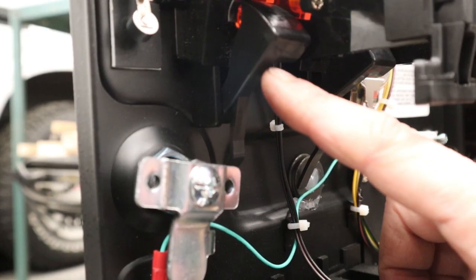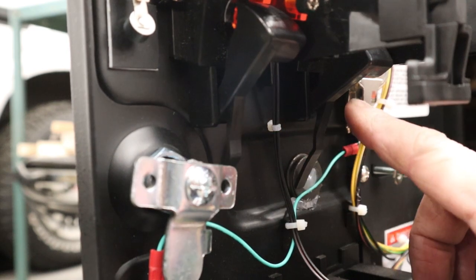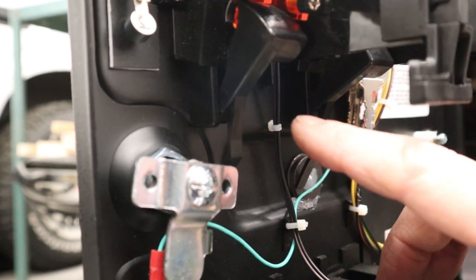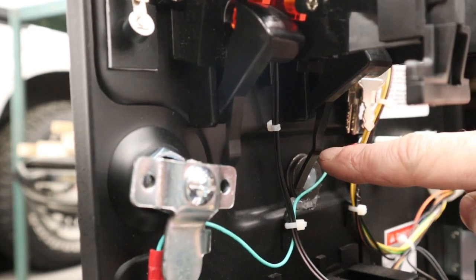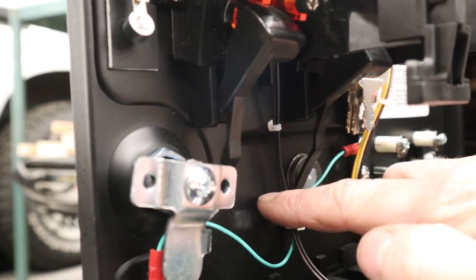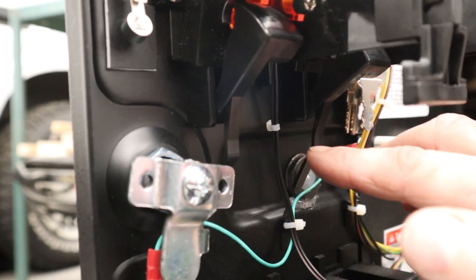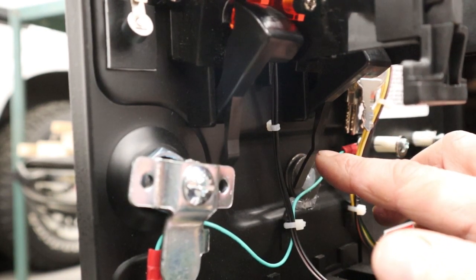The black plastic piece that the micro switch is clicking on is this piece here. And these are exactly the same. What's actually happening is this one here is in a dip or a recess in the metal part of the panel, and so there's way less tension on this, which makes it quite loose. So if you take a look on yours, you'll see what I'm talking about.